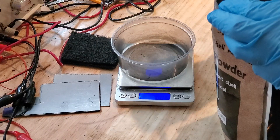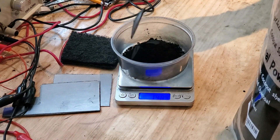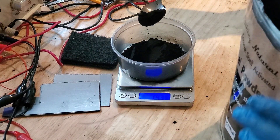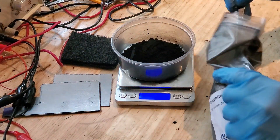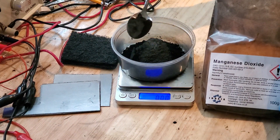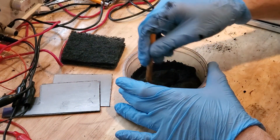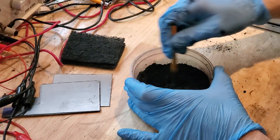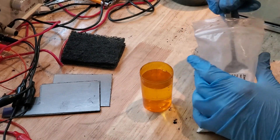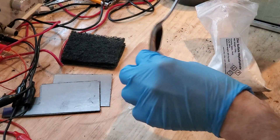The cost of this battery cell is under $1. I'll start by measuring 15 grams of coconut carbon — this is the main ingredient. Next I'll add 6-7 grams of graphite and manganese dioxide. Stir the ingredients well. Now we're going to turn this into a paste using our electrolyte. First I'll add a heaping tablespoon of zinc sulfate to distilled water in a 20 dram pill bottle. Stir the electrolyte until the solution becomes clear.